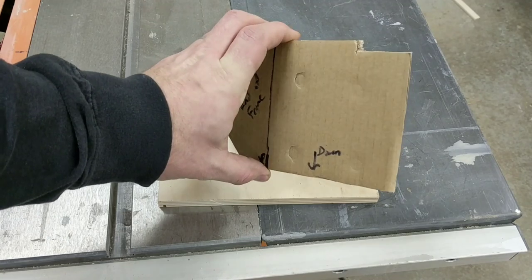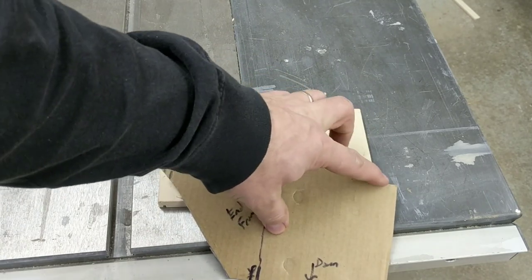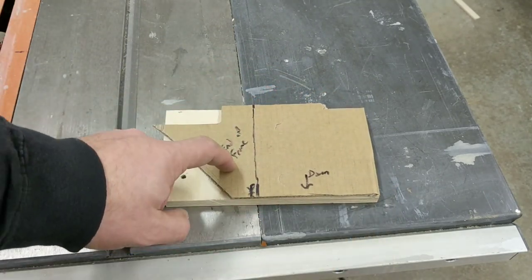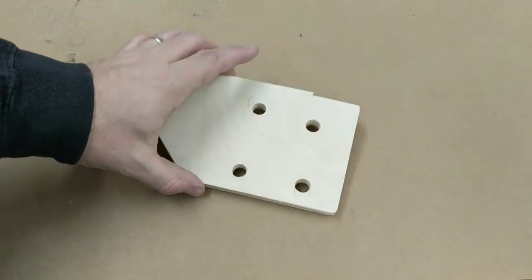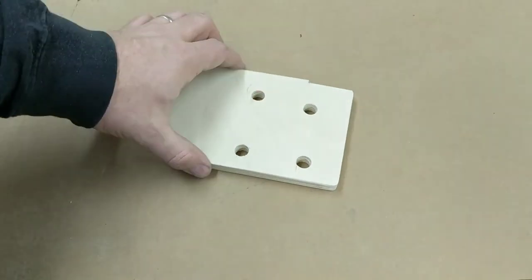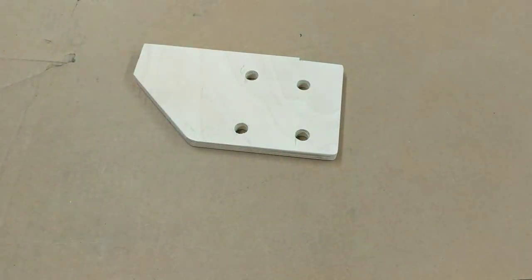So I took a piece of cardboard and smacked it into the ends of the bolts and notched around various rivets and parts I need to go around. Rather than cutting into steel, I'm going to make a quick wooden template. It doesn't look that complex but it actually does take into account some things on the top and bottom that are difficult to explain. I made it from Baltic birch with nice sanding.